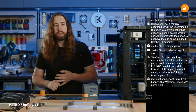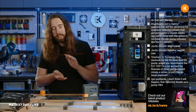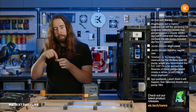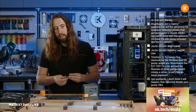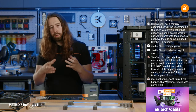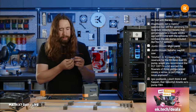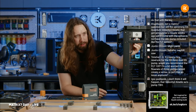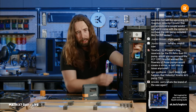No, I'd recommend getting the smallest little X3 that you can get and putting the port with the single top with the extender, and you can male-female it directly onto the D5 and just put the shortest tube in, and then it will all be the same kind of width, whereas a 120 will probably make it bigger. The 120 also, it's a bit tough to get air out of it, especially with that kind of ridiculous flow from dual D5s.